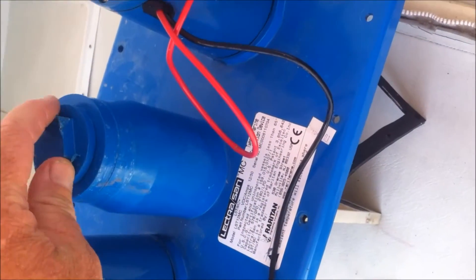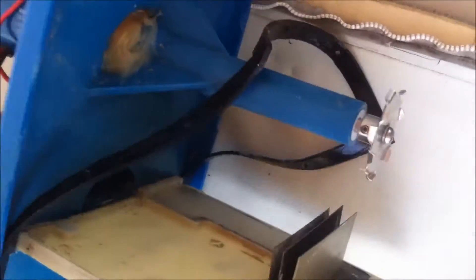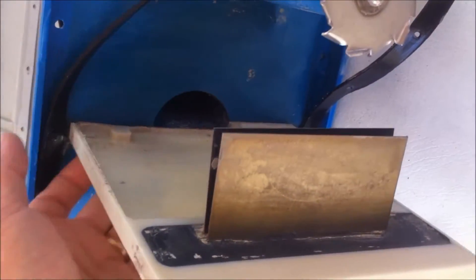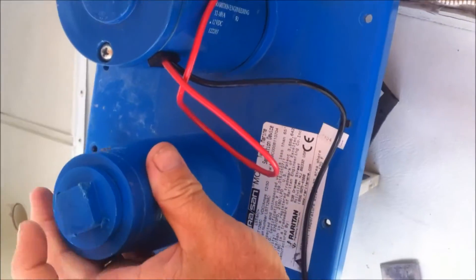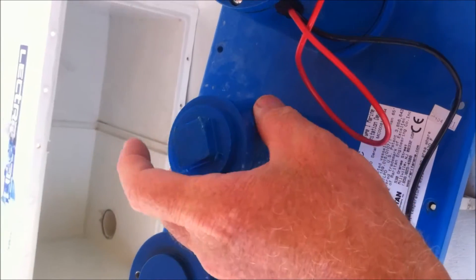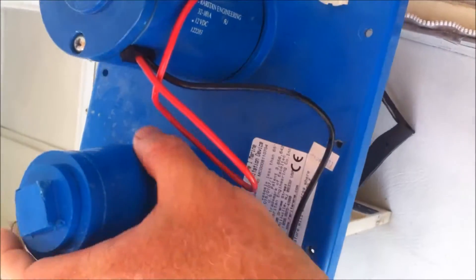This is your cleanout unit — you can see it from the bottom. It's where material flows from one chamber into the next, and it can be cleaned out periodically with a shop vac just by unscrewing this piece here, putting the shop vac on top, and getting any material that might be lodged in there out.